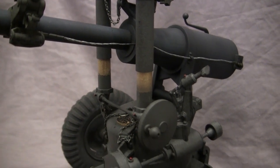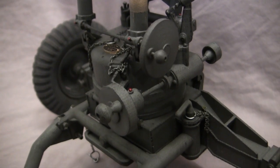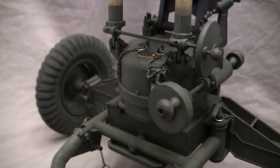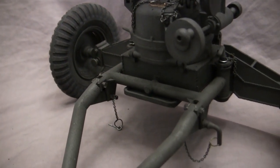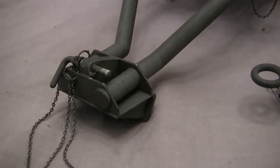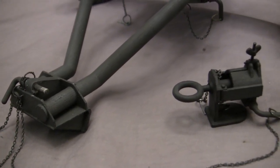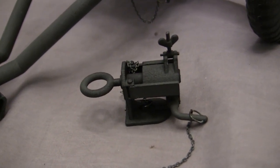The way these systems work is with the rear venturi design. Unlike a locked breech artillery piece where the unit must contain the entire explosion of the propellant in order to propel the round down the barrel, with a recoilless system, most of the propellant gases are vented towards the rear of the unit and off into the atmosphere. Very similar along the lines of a shoulder-fired bazooka.